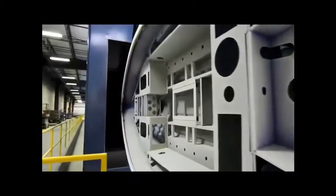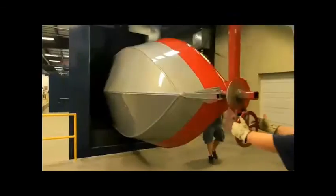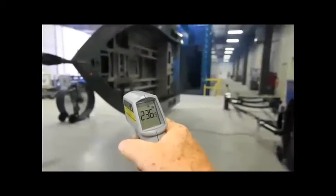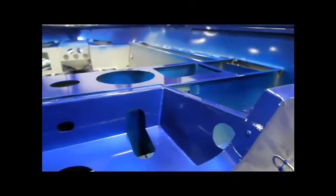Then it's into the long bake. This oven will cook the entire boat for about 20 minutes at over 400 degrees. Once it's done, it's pulled out of the oven and left to sit for a few minutes under a series of fans to cool. Here's one that's just come out of the oven, and it still measures just under 250 degrees. And when it's done, the finish is perfect, as well as durable. The level of gloss is amazing to see, considering that the final coat went on white.